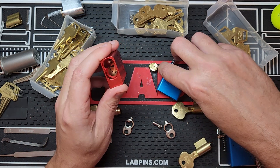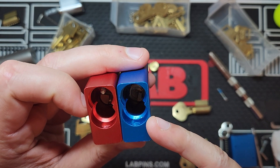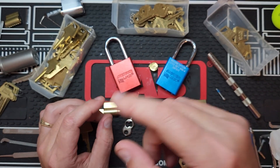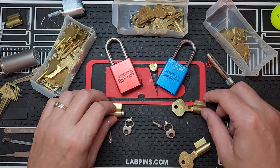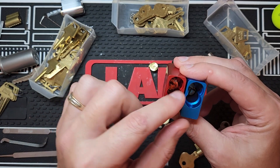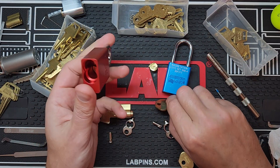As I talked about in my other video, these are timed differently. The actuator block that gets engaged on the Master Lock has the actuator on the bottom right, and on the American it's on the bottom left. Chris wondered about the Bibles being different heights — these are the same, same cutouts on both. They're both 1100 bodies, so the Bibles fit. There's a notch for the American one that's longer and the Master Lock one just never reaches as far into that notch, so that doesn't really play into anything. It's the actuator position.